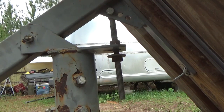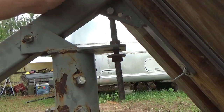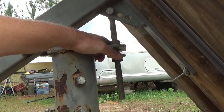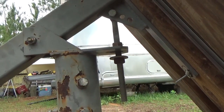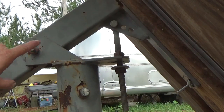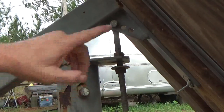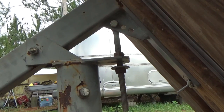What you're looking at is the adjustments for our little solar array. If you watched the previous video, I mentioned that this part here is nothing more than the old-fashioned adjuster for one of the big giant eight-foot diameter dishes they had back in the 80s. It pivots right here, and then you use this nut here and this nut here to adjust it up and down. So what we're gonna do is just mess around with it until we get right at 50 degrees, which is just about right for my latitude this time of year.